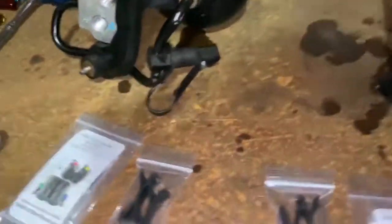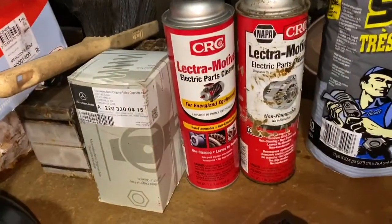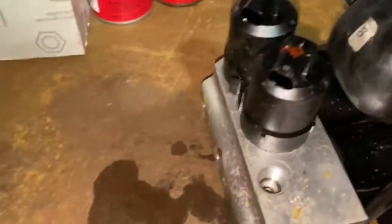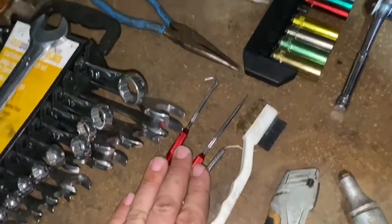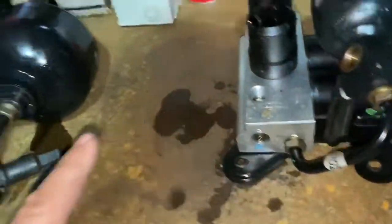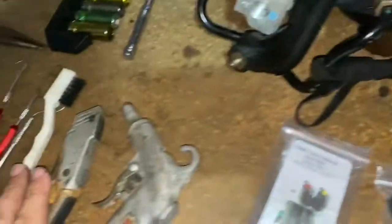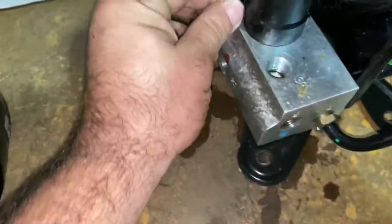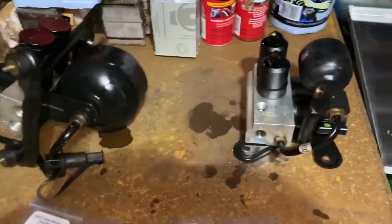Other things you're going to need to do the job: I elected to use electric parts cleaner because of the electronic solenoids, some towels, some air, probably a razor, a little brush for cleaning, some picks to pull the seals off, a 17mm wrench to pull the hoses off, a 10mm wrench to remove the plates from the valve block assemblies, and possibly a screwdriver to get the clips off. We might just be able to squeeze them off. I've never done this job before, so we're going to figure this out.